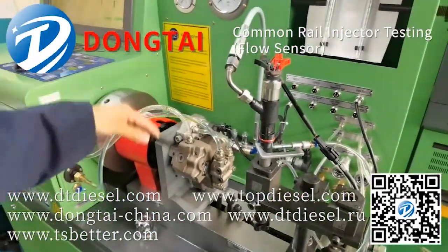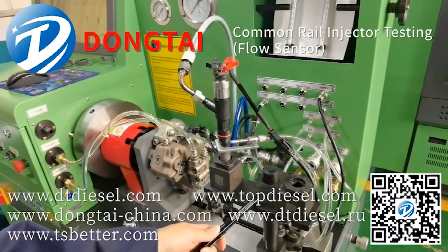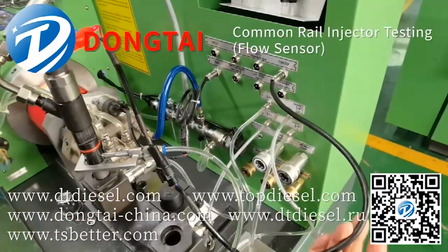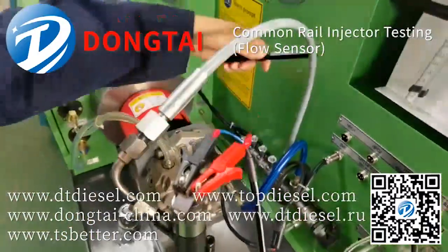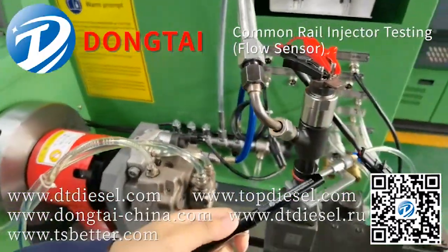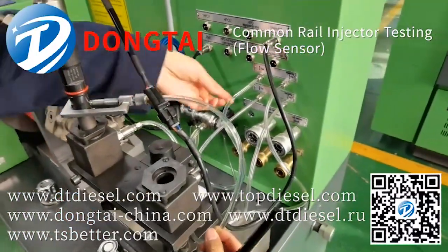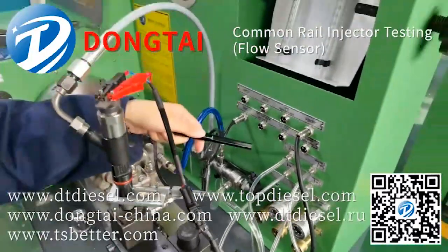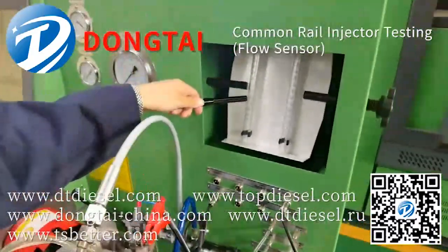First, set up the common rail pump and connect the common rail injector on the injector stand. Connect the injector cable on the solenoid valve of injector. High pressure oil pipe. Connect with the common rail and the injector. Oil injection pipe. Connect with the flow sensor. We have two ways to check the oil flow quantity. One is by flow sensor. Another one is by the glass tube.